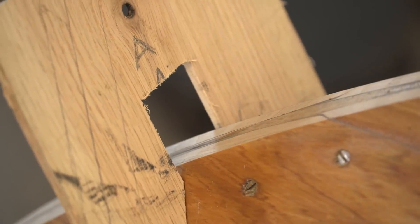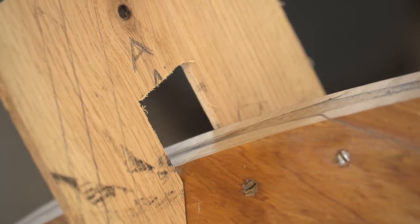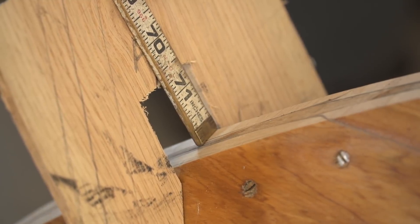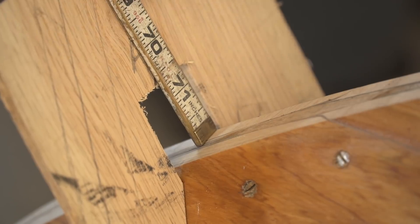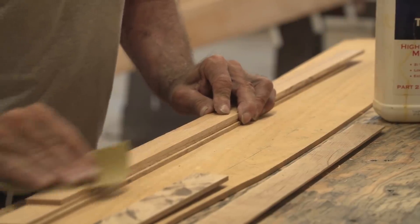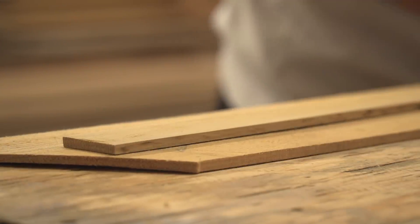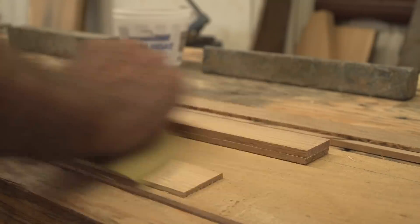Here's the last jig — we're going to put it in position, wiggle it back and forth to make sure it fits. Caleb's going to hold onto it for me. It takes two guys sometimes to do the smallest thing. We wiggle the rule back and forth to get it on center line, and I transfer my little line onto it. Now Caleb and I have decided to sand these laminates just a tiny bit — it's a matter of taste, but I like sanding them especially where the table saw might have burned them or they've got a glaze from handling.